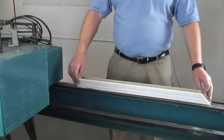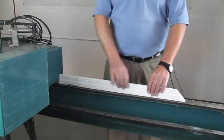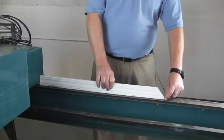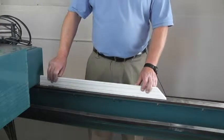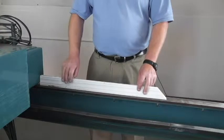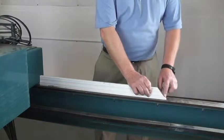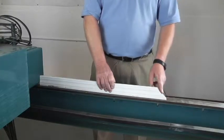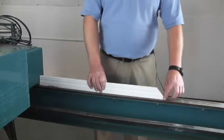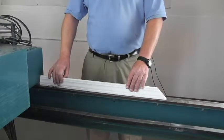Now that I've cut the two short legs, put them back to back on the bed of the saw, line up the two 90s and look at the lengths. The lengths should be approximately the same. If the lengths are not the same, then the feed stops are not set correctly. This is also a good way to check your saw on a daily basis — cut two short legs, butt them up, and check to see that the 45s match. If your 45s have been good the day before, the odds of both 45s being off the same angle is astronomical, so if they match you're secure that they're still 45s. If one is different, go back through the procedures for setting the 90s and 45s.